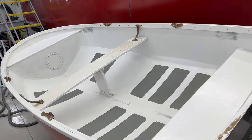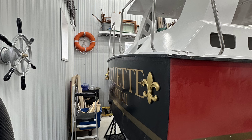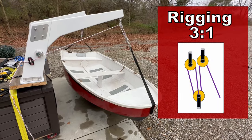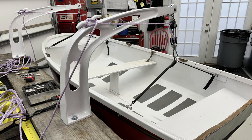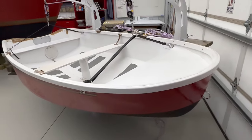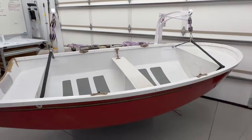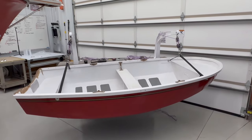If I can find a way to mount the Bremer davits to the back of my pocket trawler, I think this is going to be a very elegant solution. Before we start drilling holes, let's take a minute to make sure that these Bremer davits can actually lift something. I've gone ahead and created a simulated boat stern on which to mount the davits so I can see how they work. With the composite dinghy davits I used a 3 to 1 purchase; this time I've changed to a 4 to 1 purchase and I want to make sure things go smoothly. Even without the little winches, the new davits work perfectly. Now that's what I'm talking about! What I'd like to do is get inside there and see if it'll hold me, but the simulated boat stern just won't support it. So what I'm thinking is attaching the davits to the stern of the boat and doing an actual test — I'll create a porch swing that I can sit on. We'll see if the boat and the deck can actually support me.